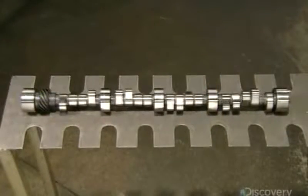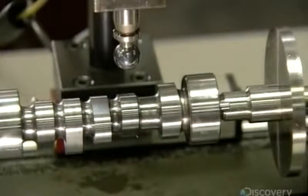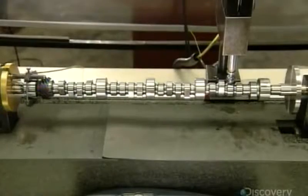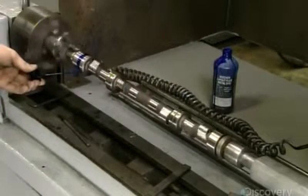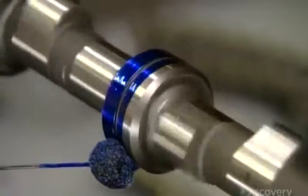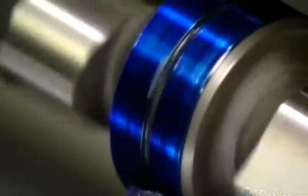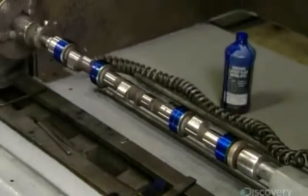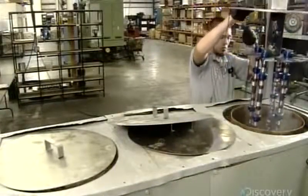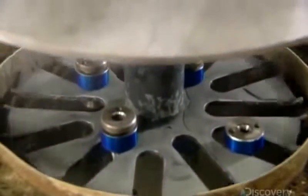This is how the camshaft looked before the master grinding, and after. Next, a computerized probe measures the profile of each lobe and confirms that the dimensions and lift are identical. At the next station, the camshaft spins to allow a worker to completely coat the journal bearings with a blue dye. The dye masks the bearings to keep them smooth, while the rest of the camshaft is being parkerized. Parkerizing will give the camshaft an etched finish, which protects against wear.